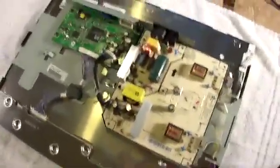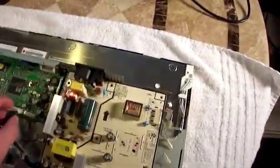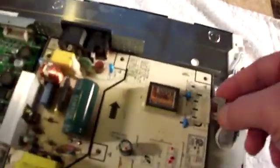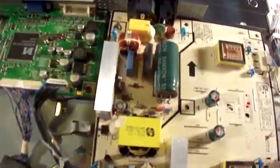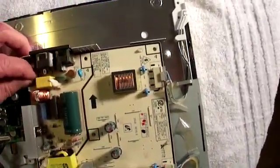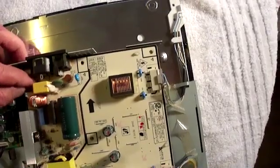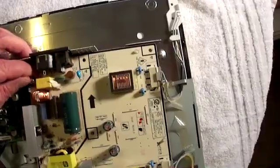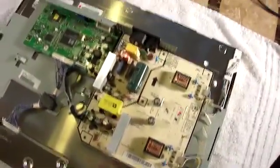I've put the insulating black cover back on the back and dropped this into place. I'm going to go ahead and plug in my plugs and attach my five screws, and then we'll be ready to replace the large metallic back cover. Remember your black screws here — there are three of those and then one big silver screw. Once we put that together, we'll move on to the next part.